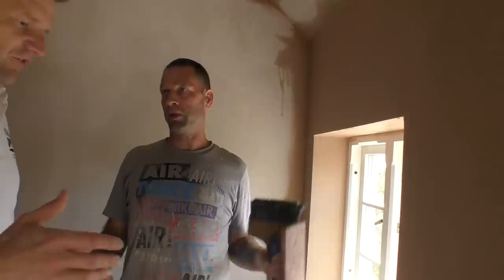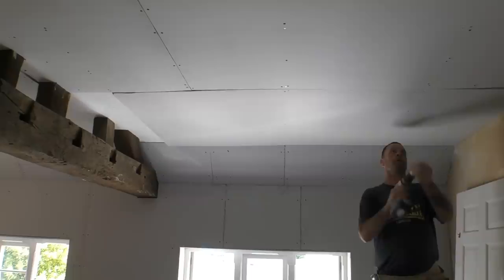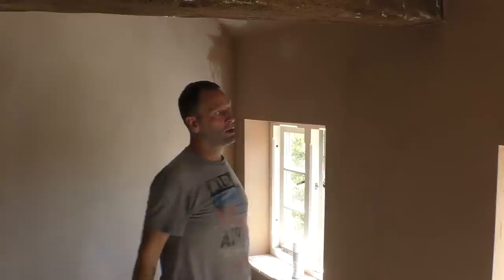Or where you've battened a new wall. This wall in here I've battened and covered with insulated plasterboard, but the ceiling — which will be in my next video — we had to re-board. Just look what a mess it was before with woodchip and a cardboard-type material we couldn't strip off. Below a lot of the ceilings we've got Gerard to skim straight onto it, and with nails projecting down the ceiling is literally all over the place. You'd never have been able to do it with a wide trowel, would you Gerard? No, that's right.